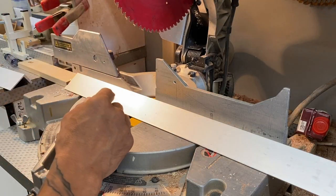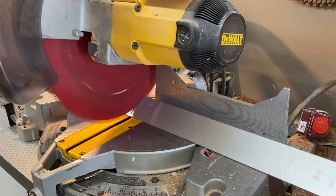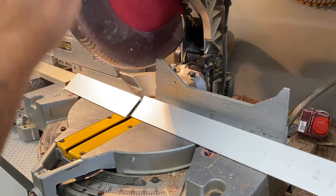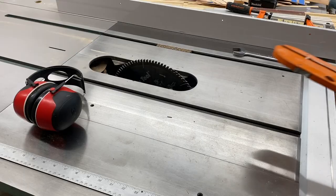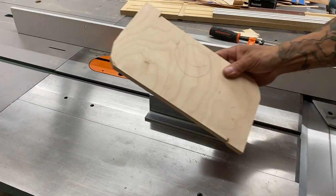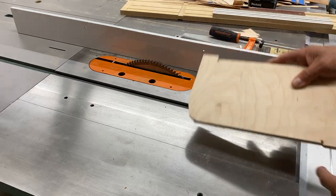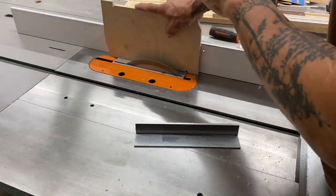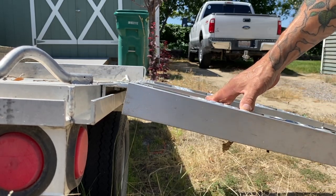This blade is not designed for aluminum, but it's getting dull and it's a fine-tooth blade, so I thought I'd give it a try. Since this blade is not designed for a chop saw, I held the handle down on the chop saw until the blade stopped spinning — that looks pretty good. After installing a blade for non-ferrous metal at the table saw, I made sure I had a push block with an eighth-inch or less hook to push those pieces through. I should have used a zero-clearance insert — a small piece of aluminum fell into the cabinet saw, but didn't hurt anything.